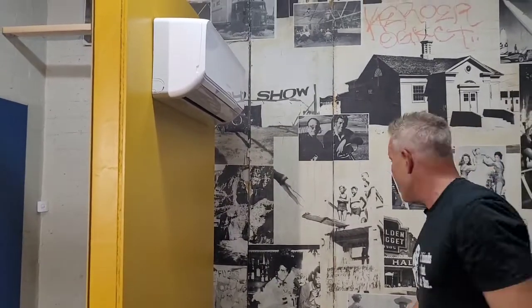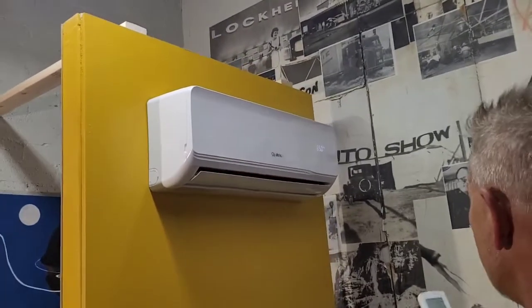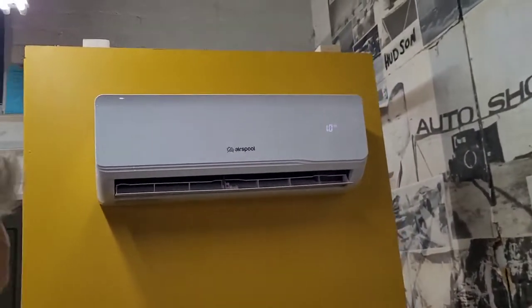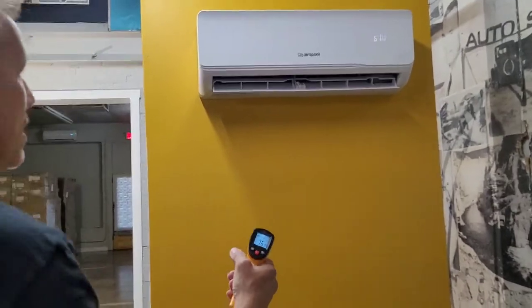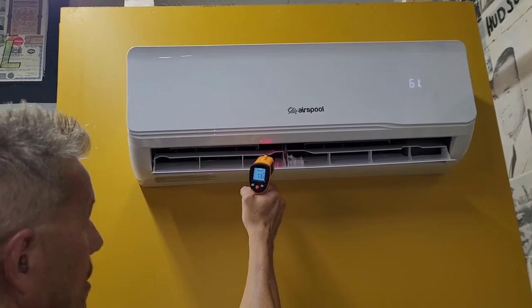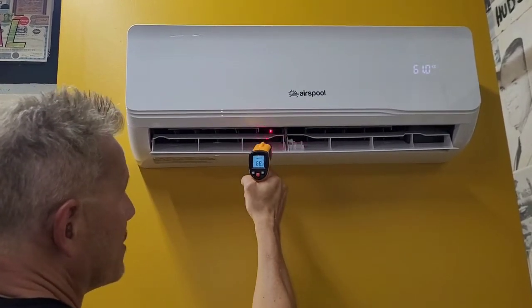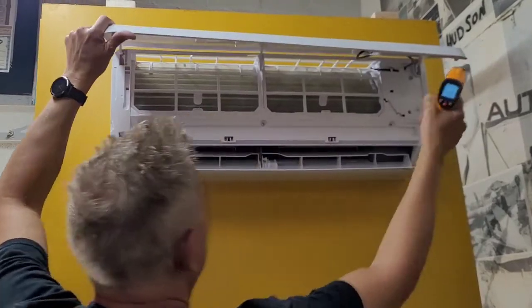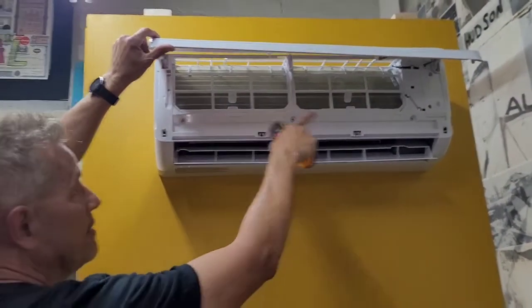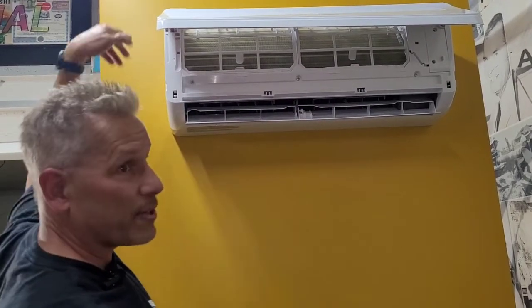How long did that take, Todd? Seven minutes. Seven minutes — we started with three, so we're at less than five, even with me doing a little bit more talking. Turning the unit on — the room right now is 77 degrees. The coil takes a minute to get cold. It's going down — 63, 62, 60. We'll get down to maybe 45 degrees. The refrigerant's starting to come through this indoor coil. As the refrigerant circulates through that coil, return air comes through here, supply air comes out here. It's totally ductless — that's how mini-splits work.